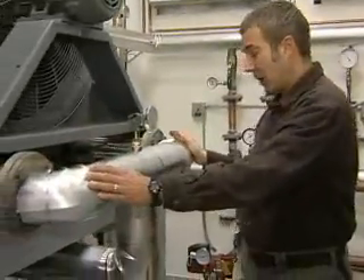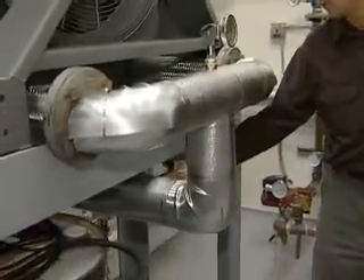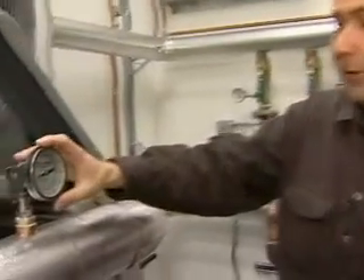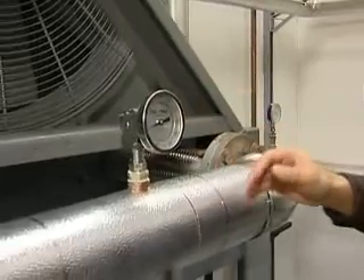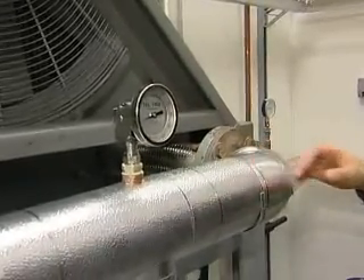On the bottom, we have the return piping that comes out the bottom, and then there's another isolation valve down below. There's also a drain valve there that allows us to drain down the radiator when it's valved off to be serviced. In the return piping, we have a thermometer, which allows us to monitor the temperature coming back in the piping from each radiator.